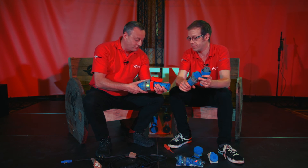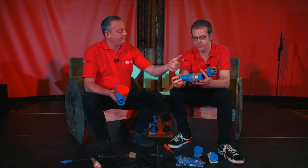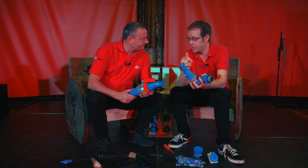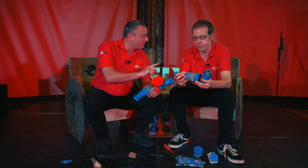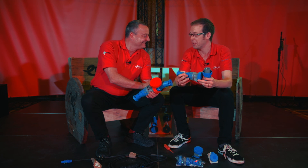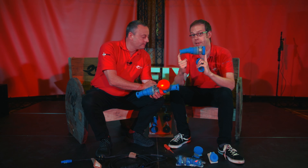Ergonomically, it's a fantastic, lovely feel in the hands — you wouldn't believe an industrial plug and socket could offer that. The cord grip at the back means no fighting with screws to pin the flex into place. Cage terminations inside mean no damage to cables or conductors from over-tightening. The gaskets appear to be pre-moulded onto the plug itself. We should follow through and look at these in greater detail from a manufacturing perspective — if we can get to Italy, we'll go to the Palazzoli factory and see the XCEE range being manufactured, which should make for a really interesting video.